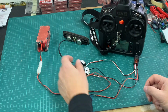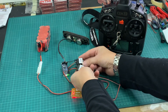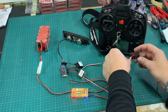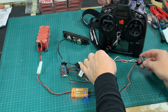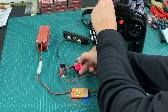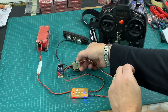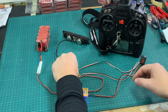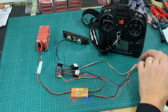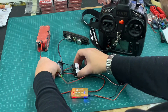These nice little items are Model Radio Workshop dual relay switches. You've got an input into the relays that comes from your receiver — it goes into any spare channel, just one channel — and that triggers the two relays. It's all on one channel but you get the two outputs, which is very useful. I'm using two channels on my receiver connected to the two relays, which give a total of four triggers.